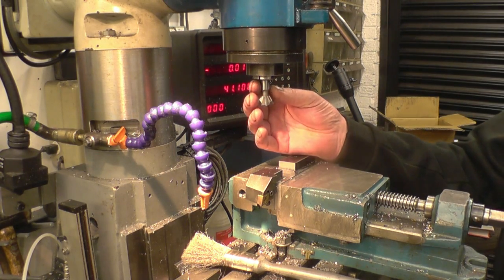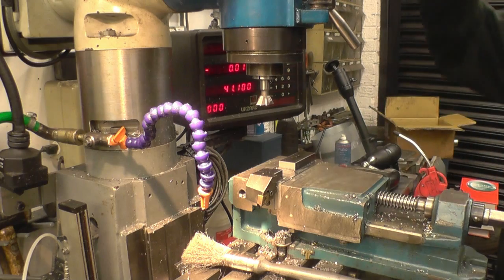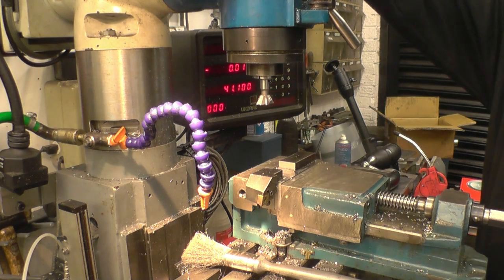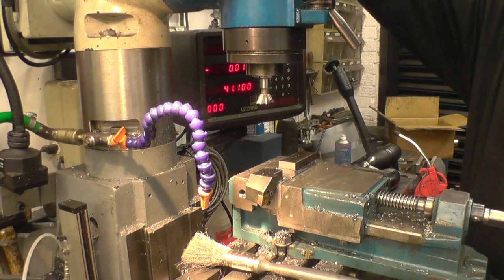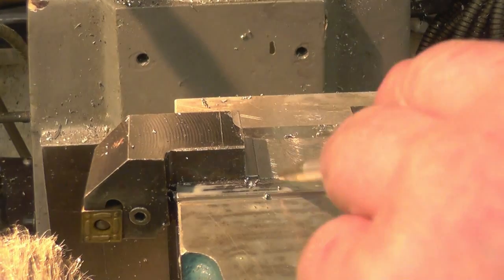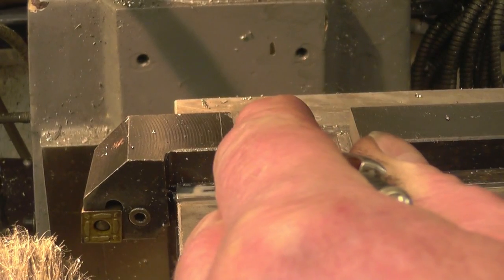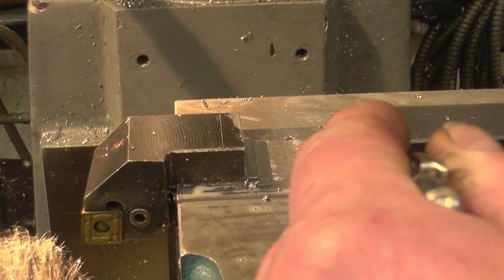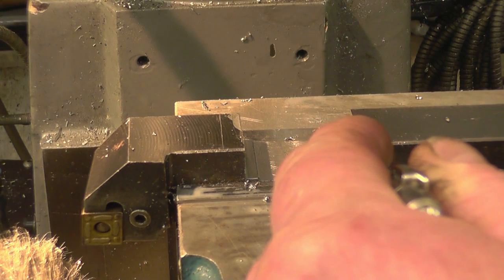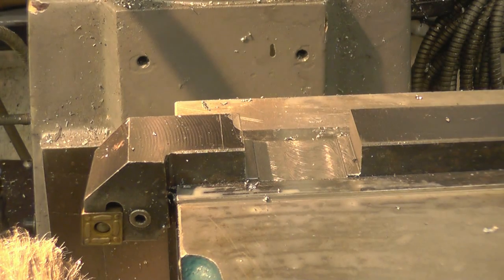You need to get a really good hold of this cutter, because naturally it tries to pull down as it's being used. I'm using Orient collets. And I've measured up and I need to go down on that face half a mil, then into there 4 mil. So we're going to machine a dovetail like that. So in from the bottom 4 mil and half a mil down on that flat.